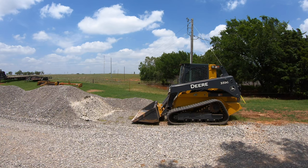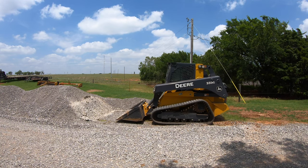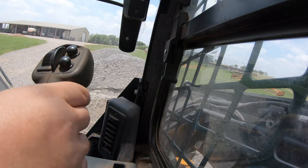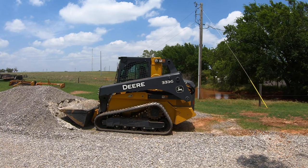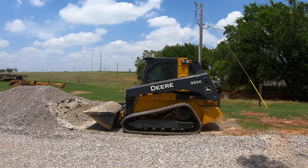Now let's go ahead and get into it. We'll go in and get a load — get us a bucket full of gravel. We'll pull forward, load that bucket up, kind of tipping our bucket as we get it loaded, shaking it back, making sure we get that full load and get it evenly distributed in our bucket. And then once we do that, we do have the self-leveling engaged.